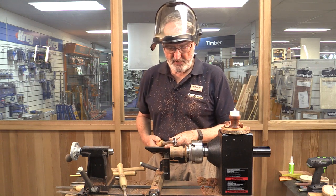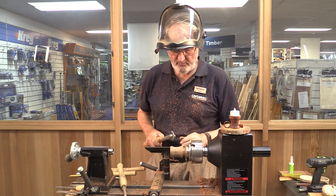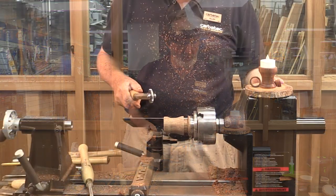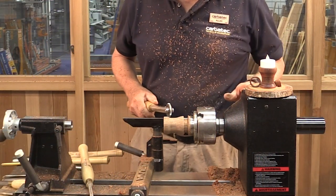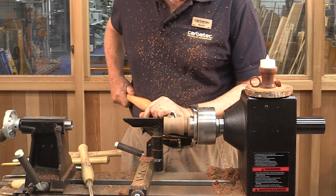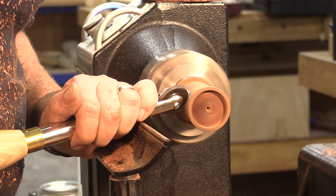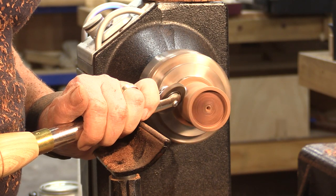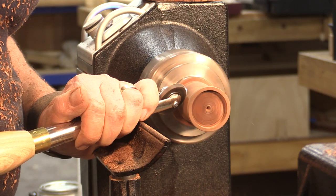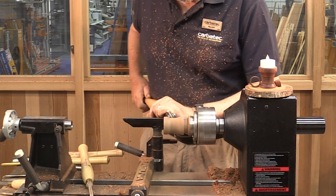So I'm going to do a little crosshatch on this. This is actually a 2mm wheel that's been fitted onto the tool at the moment. So I'll be coming in at an angle from two directions with the lathe speed down around the 400 mark. All I need to do is sweep the tool backwards and forwards while that's spinning. Then change direction.